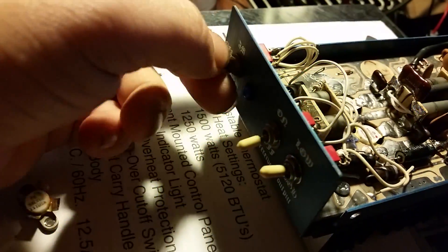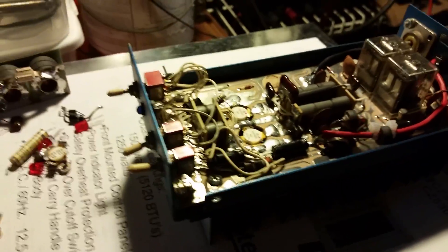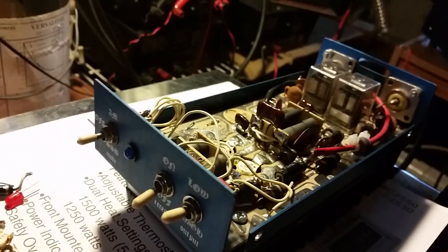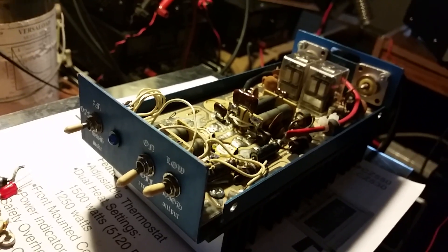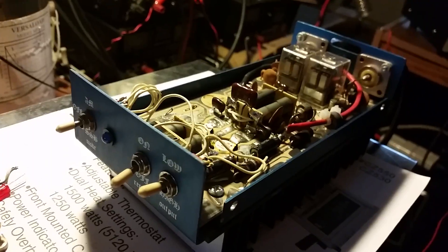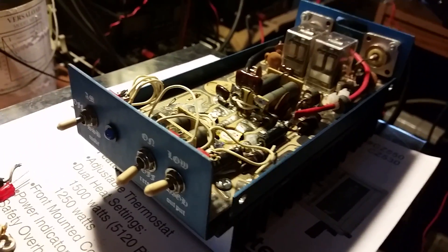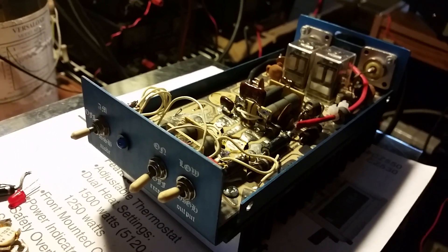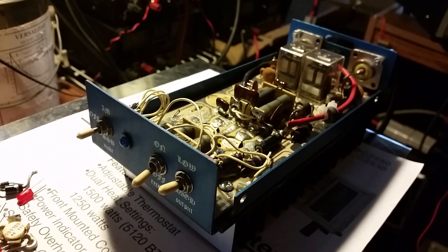Let's turn the power off — up is AM, down is sideband. This thing has an invert circuit in it. Before seeing this amp, I had only seen three other amps myself that had invert circuits. What an invert circuit does is it allows you to use your preamp with the amplifier turned off. The reason that's a big deal is because when your preamp turns on, you cannot send RF through your preamp circuit — you can only receive RF through it.